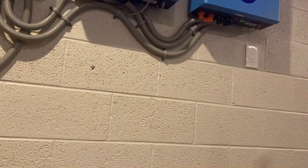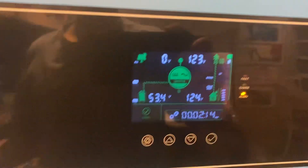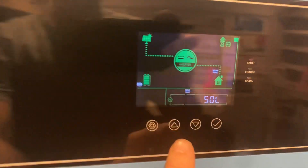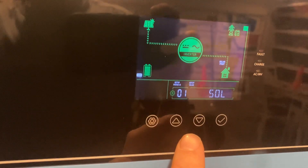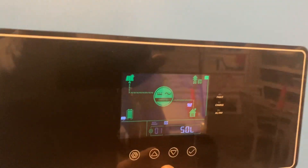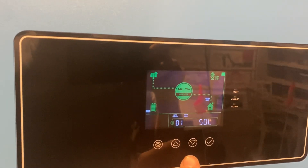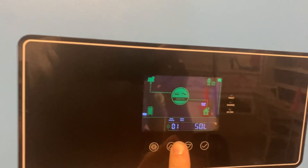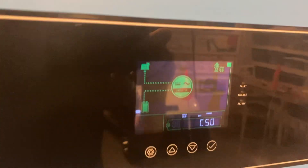Let me go through some settings I'm running. Your setup will be specific to your needs, but I'm running in SOL mode, which means solar is first priority. Utility provides power to the load when solar power is not available. When you lose solar you'll run into utility backup.